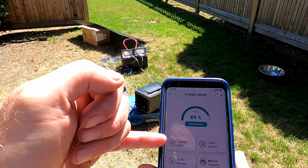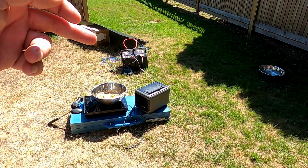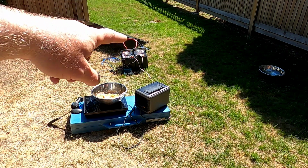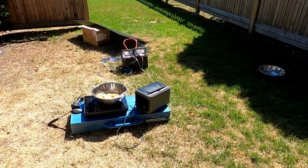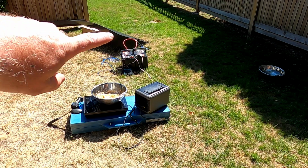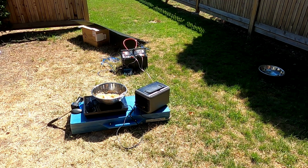usage, because really what's happening is, like I say, these solar panels are charging and it's flowing through these batteries, but because this R600 unit is taking the draw to bring it back up to fully charged again, it's making it so that the batteries in the battery stack aren't getting hammered hard. It's really, really gentle on them. And one of the golden rules with all this stuff is the more gentle the charge is on batteries, the longer their longevity will last.